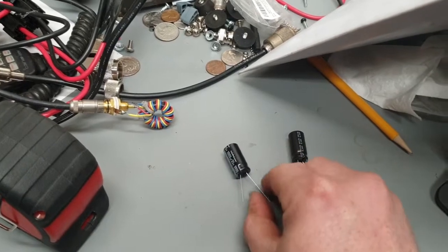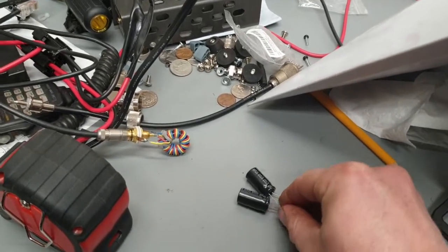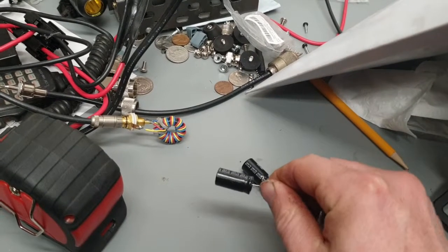So I think you're going to have to get two regular capacitors like this, and turn them around so that the positive sides are tied together, and then just twist these leads together.